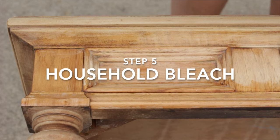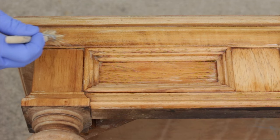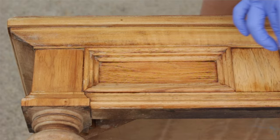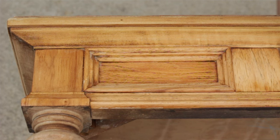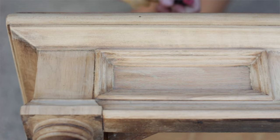After letting it dry, it still wasn't quite light enough and didn't have that raw wood finish look I was going for. I did more research and found that you can use household bleach to lighten wood. One word of warning: you will have to sand it down again afterwards, because the bleach really gets into the wood and raises the grain. I worked in small areas, didn't just slop it on, and the bleach worked amazingly — it got it so much lighter. Then I used the Gator sanding pad with 220-grit sandpaper to get it nice and smooth.